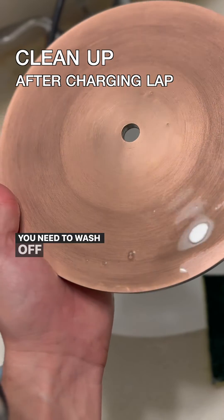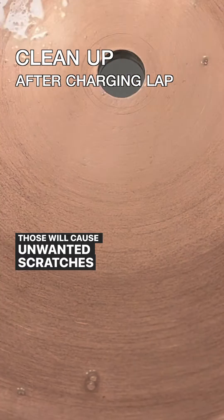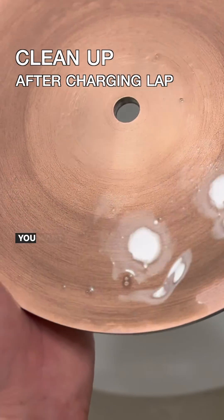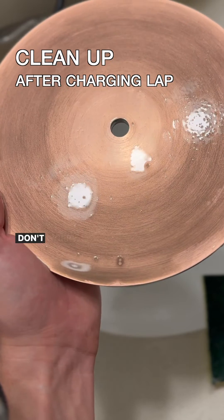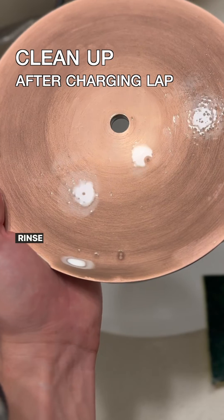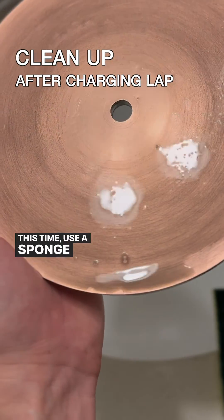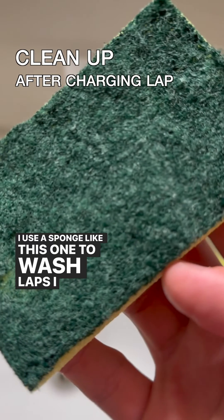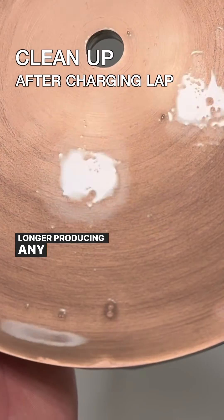It's time to clean up. You need to wash off all the loose diamonds that haven't been pressed into your lap — those will cause unwanted scratches if we leave them where they are. Put a healthy amount of soap, such as Dawn, onto your lap and use your fingers to rub the soap in first. Black swarf should develop on the surface of the copper — don't worry, it's just the result of loose diamonds giving your copper lap a nice polish. Rinse off your lap, apply soap again, and this time use a sponge with a scrubby Brillo pad attached to vigorously scrub your lap until it looks clean and is no longer producing any black swarf.